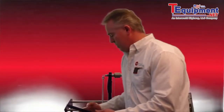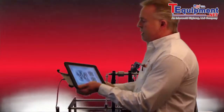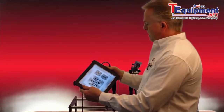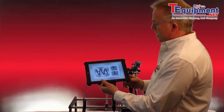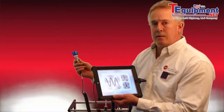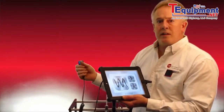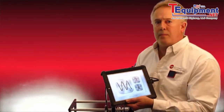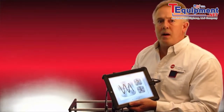What that allows me to do is go into another application such as VibePro, bring out our next modular case, which is our original vibration DAQ box and protective case. I can then plug in my dock port, and now I've got an accelerometer. I can do vibration analysis on different assets around the facility. I can do some on-site balancing, temperature measuring, depending on what I'm using my DAQ for. But it can go from the balancing machine to also be a full vibration analysis setup. So for a shop that needs all the different tools, our system is modular and able to do that.